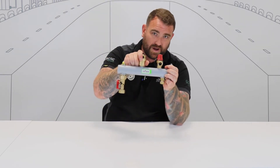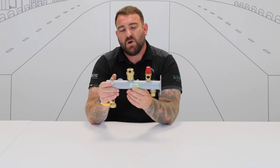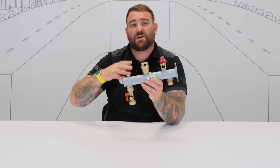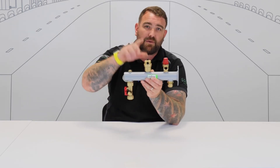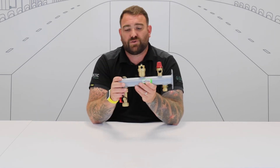Secondary, we've got an automatic air vent — again, really important when it comes to the system. We don't want air in the system because it will cause it to run inefficiently, create noise, and cause problems in radiators and pumps. An automatic air vent on there will increase the efficiency of the system and make sure it runs smoothly without any troubles.